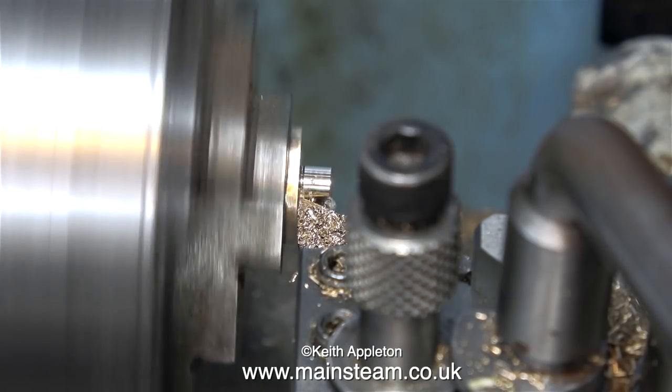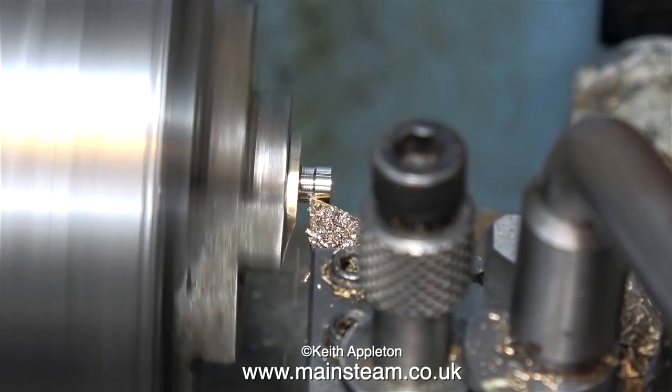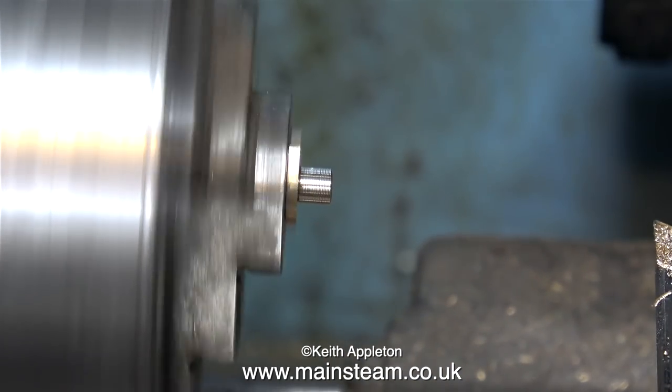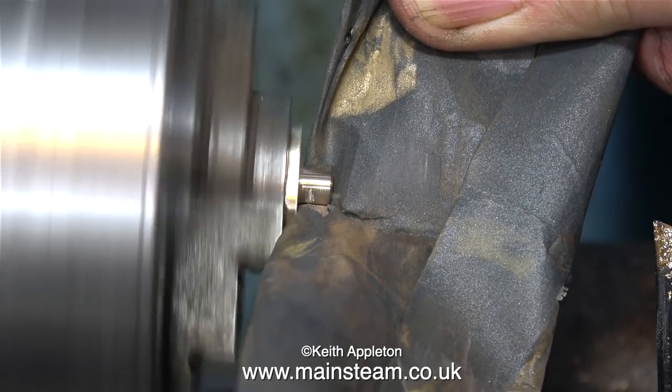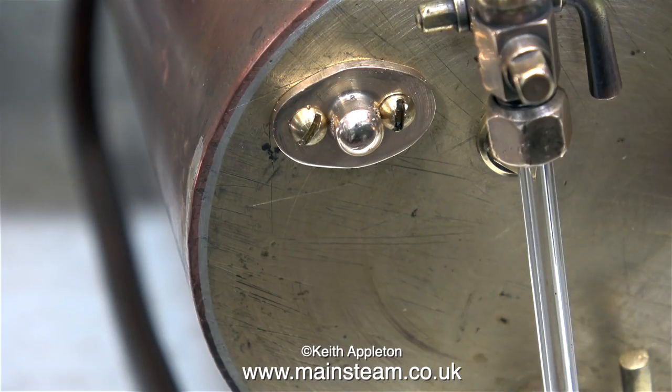For the final cut, I'm going to turn the centre using the tool backwards, so it's cutting away from the chuck. I do this fairly often — it may be a bad habit, but my logic tells me that the rear part of the cutting tool is sharper than the front because it's done less work. After cleaning up the part with some wet-or-dry sandpaper and polishing it a little bit, it looks like this. Here it is fastened into the boiler backhead — not perfect, but as perfect as the rest of the engine and boiler.